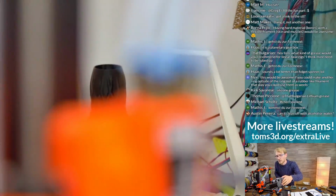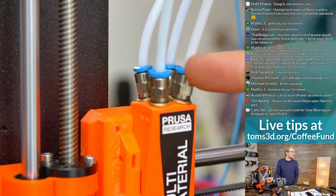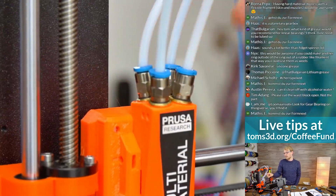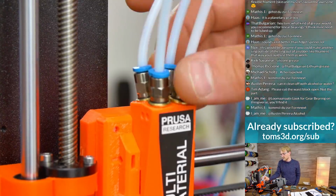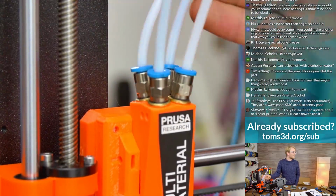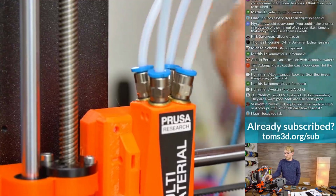Camera, come on, please. Okay, whatever. These Festo couplers up here that hold the 4 Bowden tubes onto the carriage into the Y coupler, these have no play. These have no backlash. The Bowden tubes just don't wobble around. That is probably a huge plus for print quality that you're going to get. It's going to be more precise. It's going to be crisper. It's going to string less with lower amounts of retracts. That makes so much of a difference. And compared to others, this is fantastic.